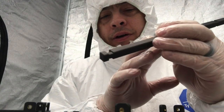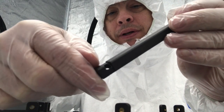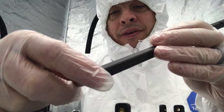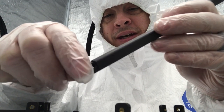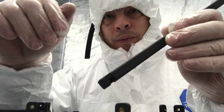An important thing to note on our rails here is that we actually created a little bit of a notch system. I don't know if the camera is going to pick this up well or not, but on this edge we have a little bit of a notch. This side is smooth along with this side. So we actually put this into our system with the notch side down so that we can hold it all together. That way it fits our CubeSat deployer in the right way.